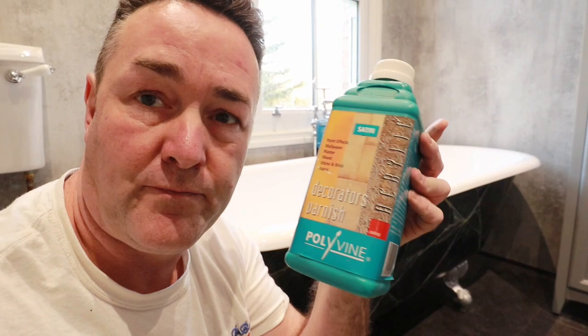Or, back in the day, when I used to do this at college and teaching and doing on jobs, if you were using oil-based, a lovely finish for a varnish would be, you used to do your marbling, you used to put a coat of oil varnish on, gloss, you used to wet and dry sand it down, and then you used to finish it with beeswax, and then just wiping the beeswax off and then buffing it off gave you a lovely silky finish. A bit extreme, I know, didn't do it a lot, but it did give you a nice finish. But now we've all moved on to water based, so we don't need to be doing anything like that.